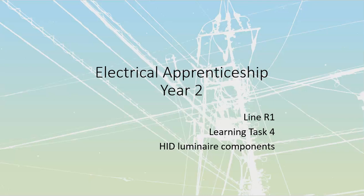All right, line R1, we're in learning task 4, where we're going to take a look at ballasts of our HID luminaires. So we've talked about the bulbs for our three main classes already: the high-pressure sodium, the mercury vapor, and the metal halide. Of those, the two that are still commonly in use are my high-pressure sodium and my metal halide. The mercury vapor, not so much so, and it was a lower voltage, older type of bulb.